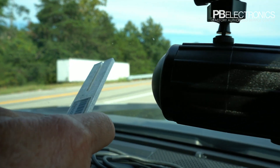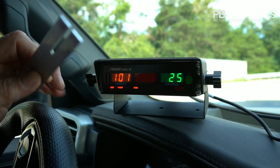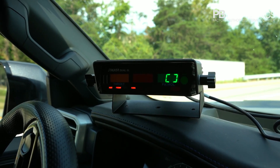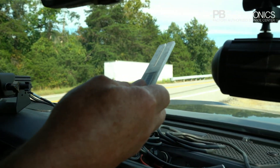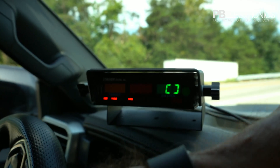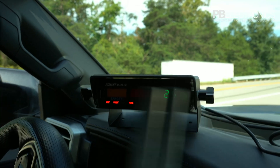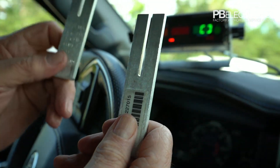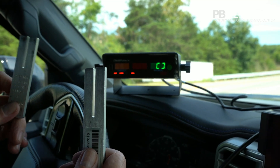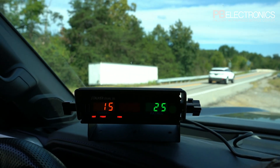I've got a 25 in the patrol window. You may get something in the target window if the tuning fork is too close to the antenna. When I hit both forks, I get a 25 and a 15 — that's what it should show. The 25 is the patrol fork and the 40 is the closing traffic, so if you're driving 25 and traffic is closing in on you at 40, the target reads 15. With a 25 and a 40, you should read 25 and 15 on the display.